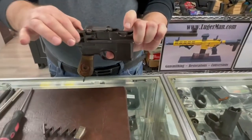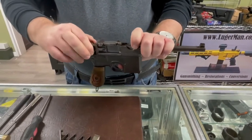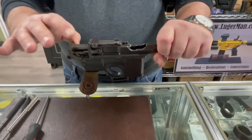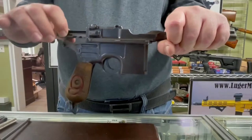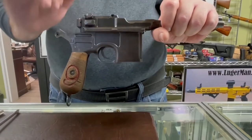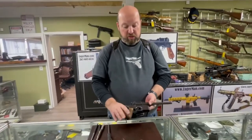If you're holding it by the upper only and your bolt opens up without you touching the lower, that means when you fire the same thing will happen — your bolt will move freely, creating a blowback situation. Eventually this portion of the gun will get damaged and destroyed, and that needs to be addressed immediately. That concludes all of our testing to make sure the gun can be fired safely.